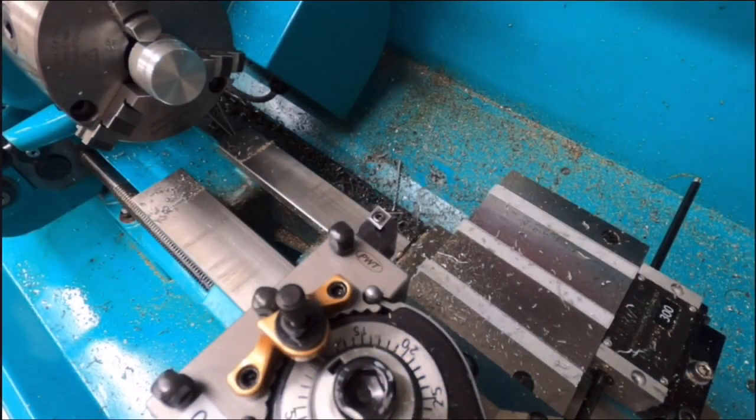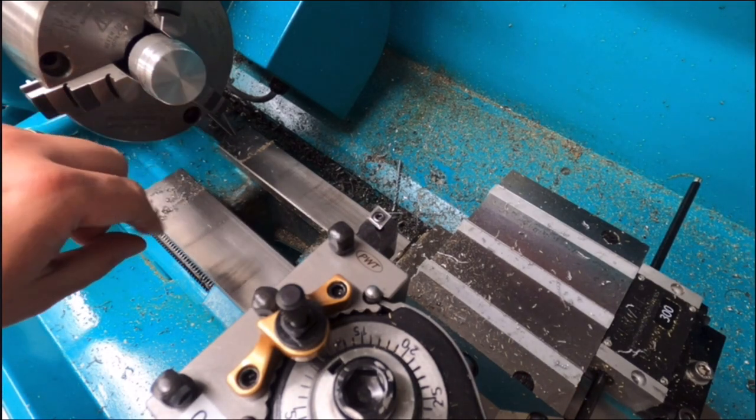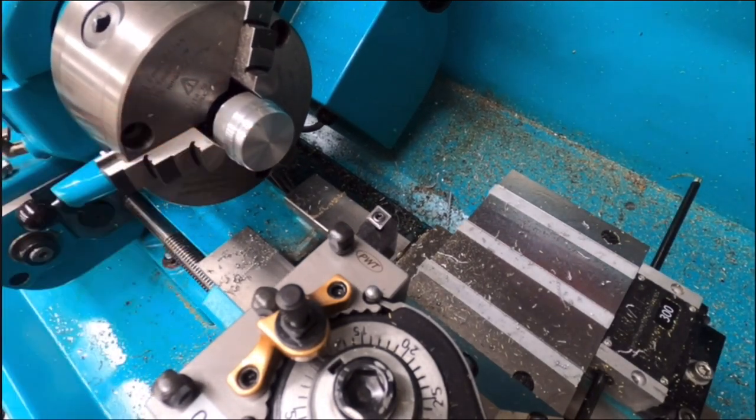Okay, so I'll give a quick demonstration now of how I set up my drill chuck on the tool post in the tool library. And I mentioned before, I think, that I assigned tool number 7 to this. So I've got the piece of gash aluminium in the chuck. So I'll face off, turn the OD just to true it up, and then we'll go from there.